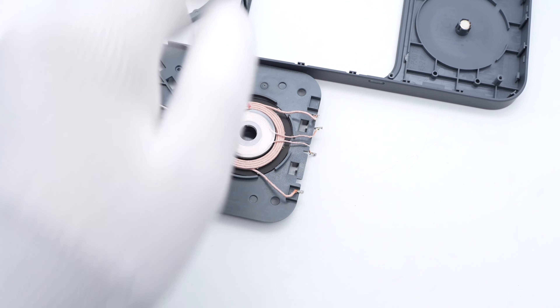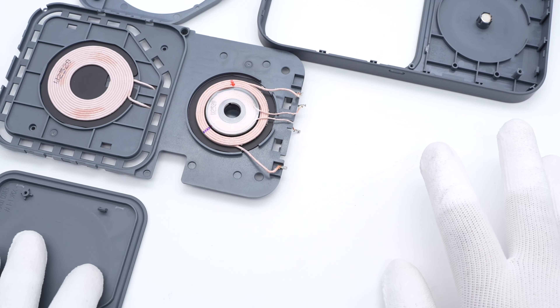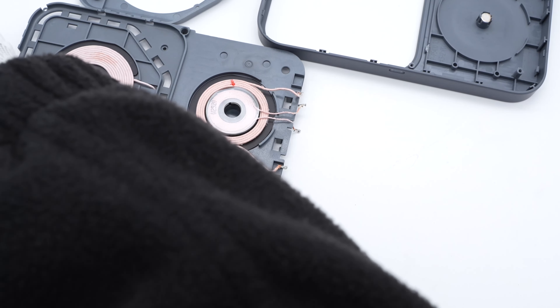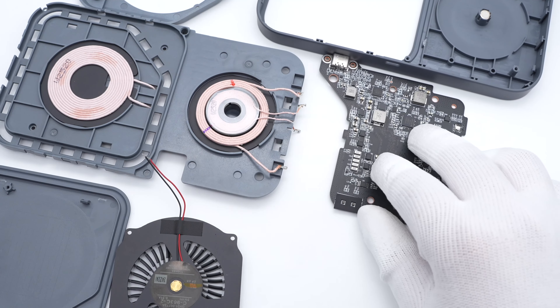That's all the components for this 15W wireless charger dual from Samsung. Compared to the previous generation, the charging power slightly increased from 9W to 15W, but the internal structure and components are significantly better. The additional cooling fan can help it maintain peak power for longer. Even the charging coil design has been improved — with two separate charging coils and a small magnet, it provides a more accurate and stable charging experience. Okay, that's all for today's video. Please drop a like, leave your comments, and subscribe. I'll catch you guys in the next video. Bye!